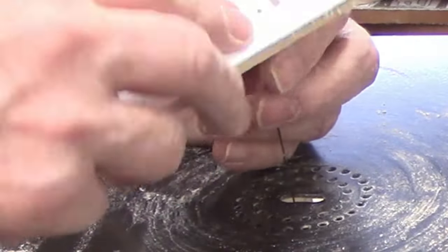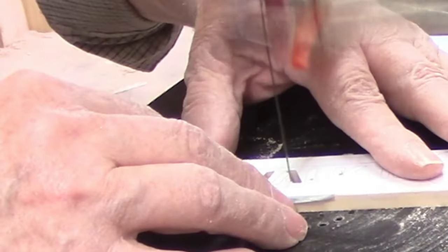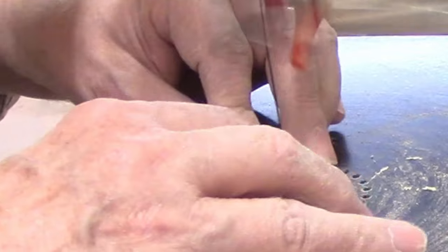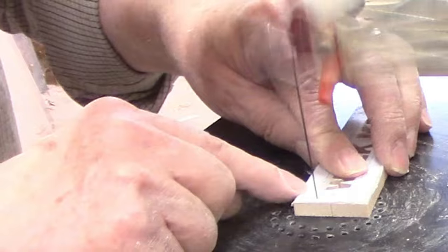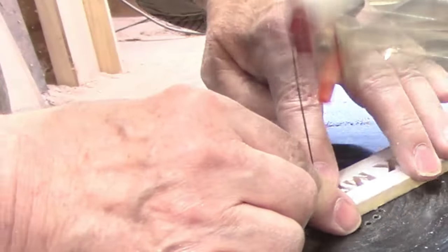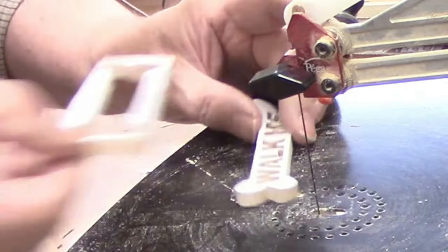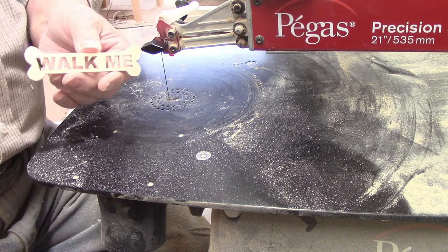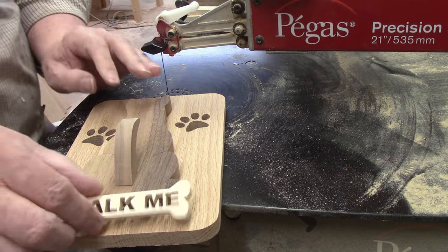When cutting the letter A, you need to be careful when cutting the crossbar. If you go over the lines while cutting this letter, the little triangle on the top may fall out and ruin the letter. Of course, this bone with writing is only a small part of the entire project, so if you ruin the cut, you can just toss this small piece and make another. The rest of the letters were relatively easy — I concentrated on staying inside the lines and making sharp corners. I started cutting the bone on one end with the point in the middle where the two curves met, and making this exterior cut was simply a matter of following the line all the way around. With the bone completed, I pulled off the scroll saw tape and pattern, then moved the backer and the dog over and set the bone on top of the backer underneath the dog shape.